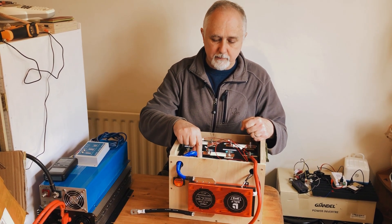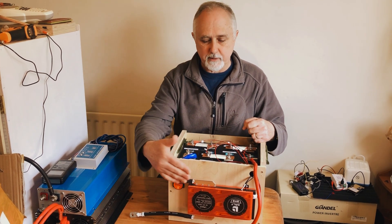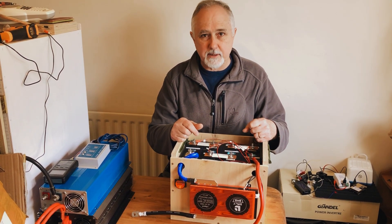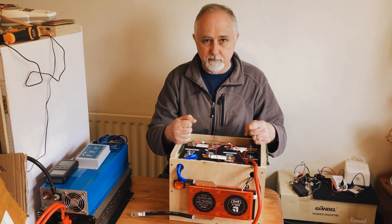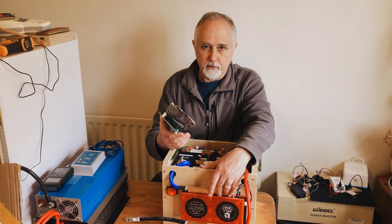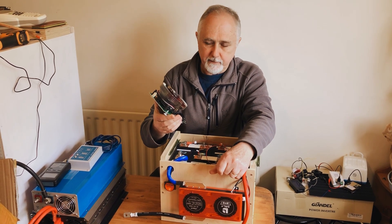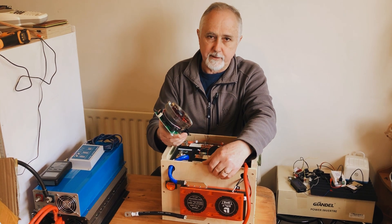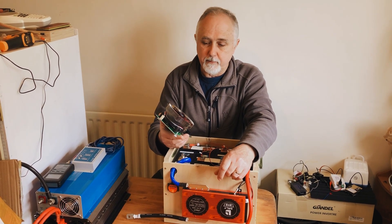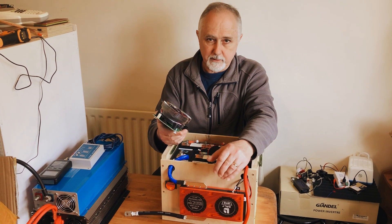As I said, they were rated at 300 amp hours. After top balancing and connecting them to the battery management system, we did three capacity tests: two low-current tests running at 15 amps and then one much higher current test running at 160 amps. The low-current capacity test was done with this tester, which goes to a maximum of 185 watts — translating roughly to about 14 amps. As the voltage decreases and the batteries are used up, the amperage changes slightly, so we kept an eye on that and kept it close to its maximum of 185 watts.